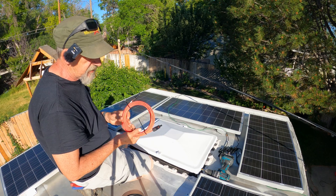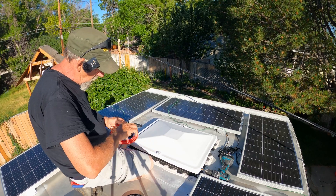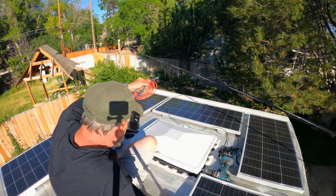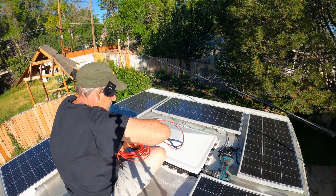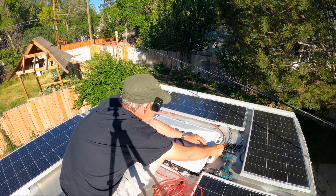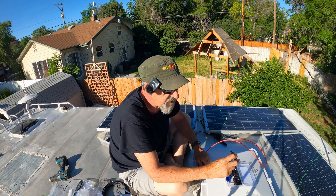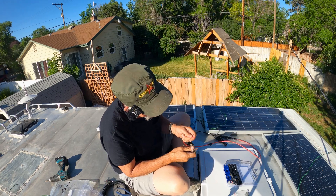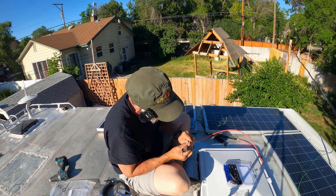So what I'm going to do right now is build some patch cables. I bought these because they work — they've already got an end attached. We'll use red for positive. It's already going to be hot out here and it's only 8 a.m. I'm going to use this existing end, positive here, and tie it up to those feet to keep it from flopping around. These connectors are called MC4 connectors — they're specific to solar installations. We terminate an end on there using a special tool. Here's a trick when you're cutting insulation and trying not to cut the wire: score it, then bend it, and look to see where it's still attached.